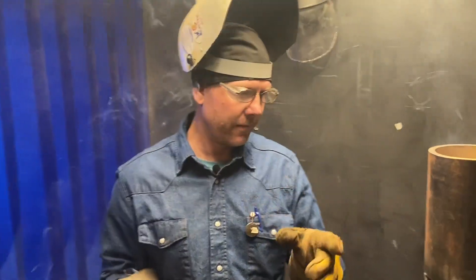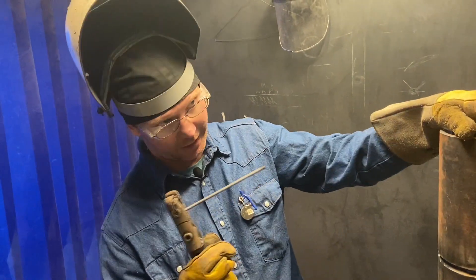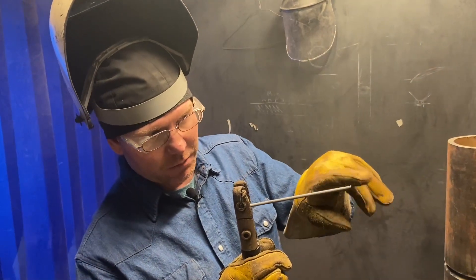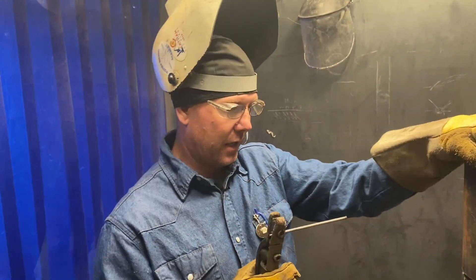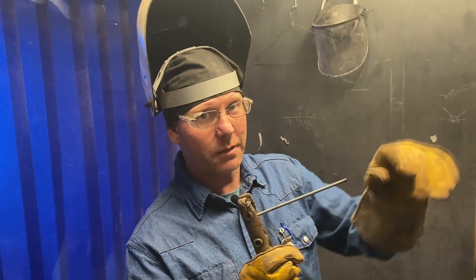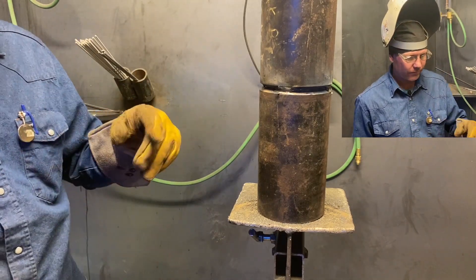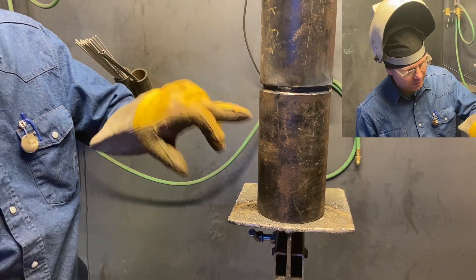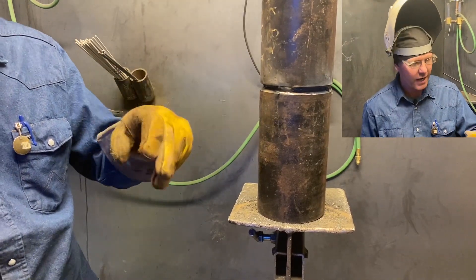When you're welding a 2G, it has a tendency to want to eat the bottom edge of the pipe out more than it does the top, simply because gravity is helping us out. So I'm continually kind of watching that top edge, and I kind of got to help it up there sometimes. You watch the end of your rod — if it starts moving like it's going to eat the bottom out, you help it up to the top and make sure that it's cutting the top out. Don't just swing up there and cut it out — you've got to hold it up there a little bit to make sure you don't undercut the inside. So the last quarter I just did, I came out of two keyholes — now I'm doing just the opposite, coming out of a start and into a start, so the tie-in is going to be a little different; I'm going to have to give a little bit more pressure on the way into that.